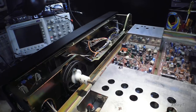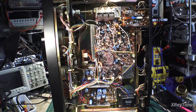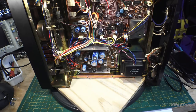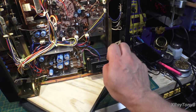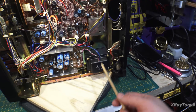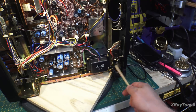Let's flip it over and look at the underside. I had to move the camera back just to get the whole thing in the shot. If we pan down to the bottom, this is your power supply section — just a small transformer since it's a tuner and doesn't draw a lot of current. Right here are all the wires for the universal power transformer and all the jumper plugs. The jumper plug on the opposite side selects the combination of wires to change your input mains voltage range. We just put a new cord in here, no problem. The power supply is regulated, very quiet, and very well-designed.